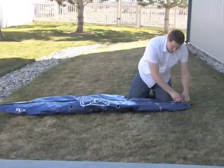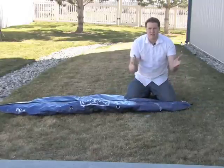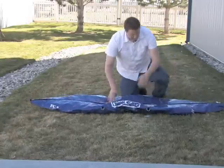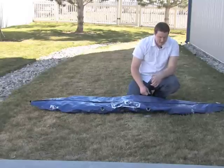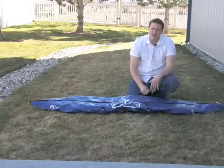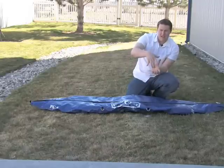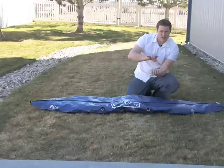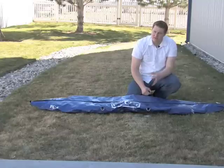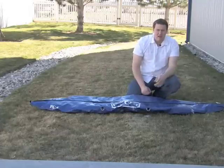Now that these are zipped together, you can just leave them at one end of the boat. Please make sure to put your split ring back on so you don't have your zippers coming open while in operation. If we inflate this and we notice that there are any issues where it is still having some twisting or any kind of voids, just go ahead and deflate it, open it back up, and make sure that it's not twisted in relation to the valve and it's not pushed too far towards one end or the other. Those are the very common causes of issues.